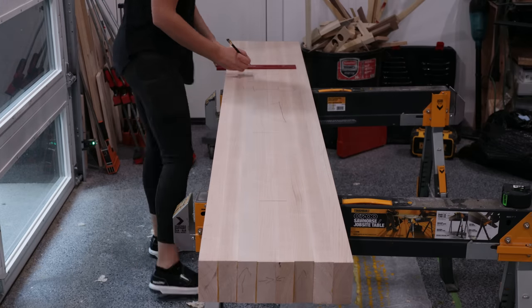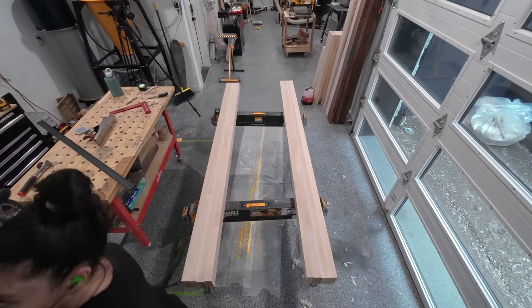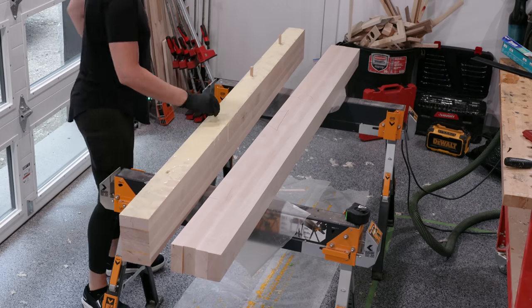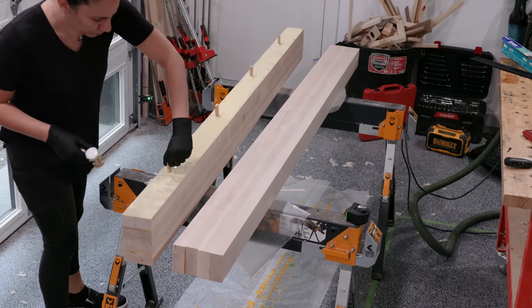This way, if the fence angle is slightly off, the opposite angles will match up perfectly — just a precaution, but it works perfectly. Now that I've gone through the trouble of cleaning up the tops and making everything nice and smooth, I don't want to have to do that again after gluing these two halves together. Dominoes, dowels, biscuits, and splines are all great ways to keep multiple pieces level during the glue-up, but they're only great if you set your tools correctly.